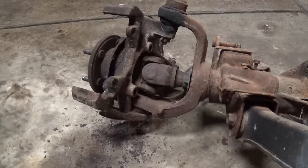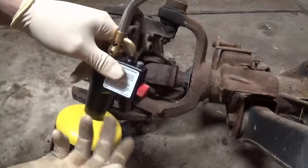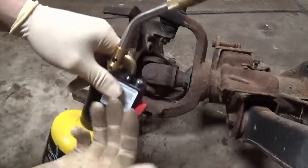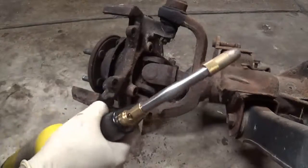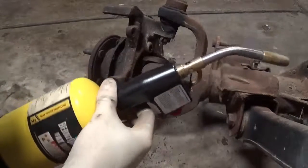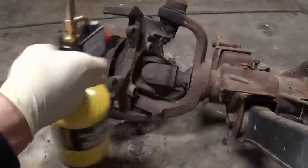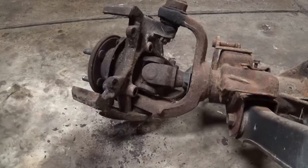So, best heat to use when you're a DIYer and don't want to buy an oxyacetylene torch: propane is not hot enough. Map gas is what you want. You can get this kit from a place like Ace Hardware — I had the bottle and the head for about forty bucks. This is the next best thing to oxyacetylene. Propane doesn't get hot enough; map gas is your best next choice. Just wanted to share that information with you — that's an FYI for removing rusty fasteners. See you next time.